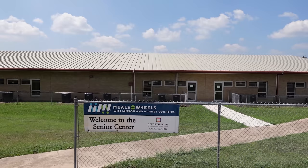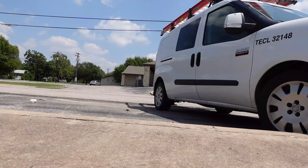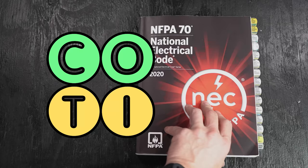This job was at an elementary school — a pre-K kind of setup — getting ready for school to be back in session. The call came from an HVAC company that had the contract to install a whole bunch of new air handlers and compressors throughout the building — 12 of each. They get everything open and start realizing there are no grounds to anything. None of the air handlers had a ground conductor — just two hots and pipe. All the outside compressors — same thing, two hots and pipe. There was no equipment grounding conductor anywhere.